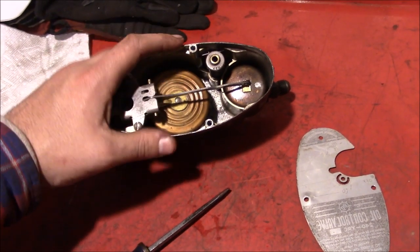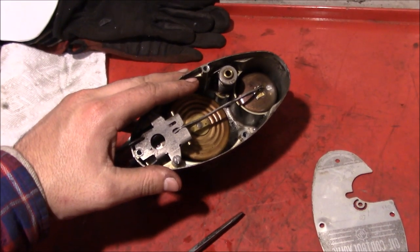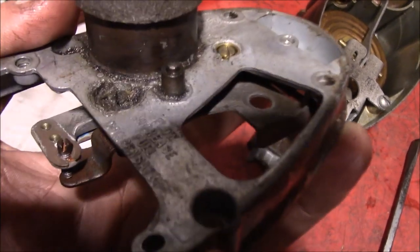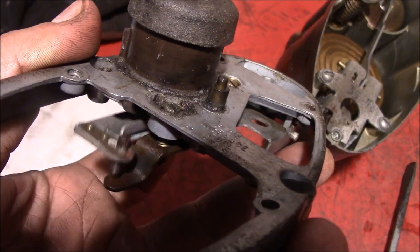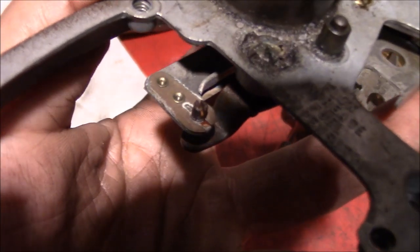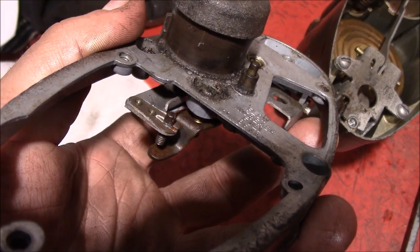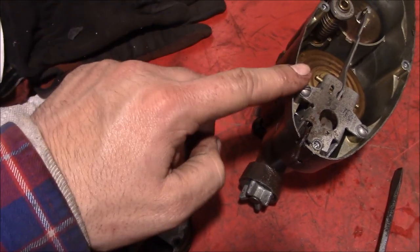If you didn't have this valve, you'd have more heat coming out of your furnace when the tank was full compared to when it was empty. When you rotate this dial right here, it moves this upwards, and that's what opens up your plunger down there in the valve. You can also see that little poppet right there — it's a visual indicator of how open the valve is. There are some little set screws down there and one up top that set the bottommost and uppermost points of the fuel flow — that's how they set the bottom and top flow rates of these valves.